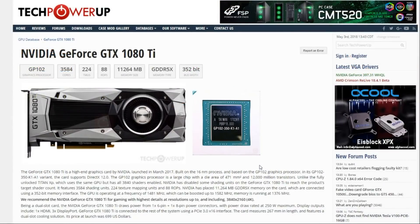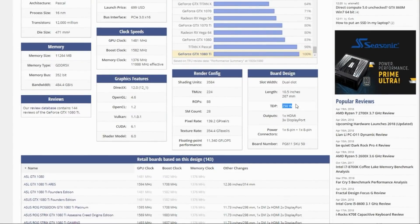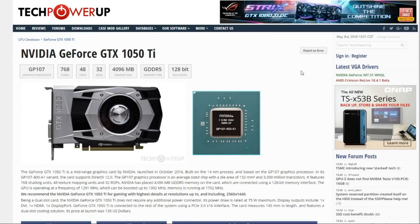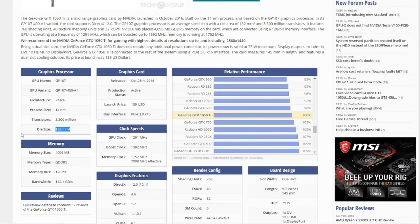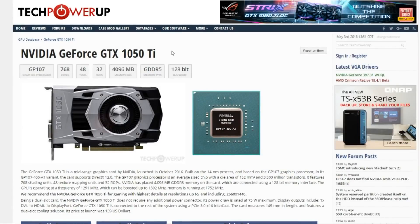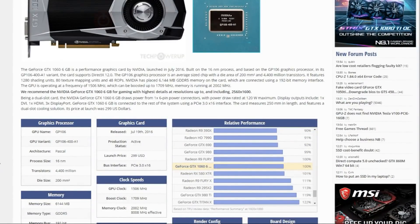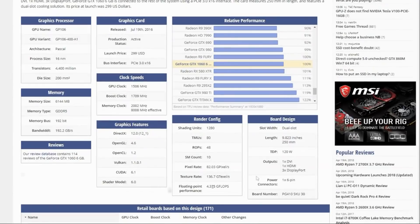However, if we're talking about GPUs, there's simply no way something like a 250-watt GTX 1080 Ti would be able to be sandwiched on top of another. That's simply not possible — it's just too much heat being produced in such a small area. This leads me to believe that when this technology does come out, they will use much smaller dies, probably something between 100 to 200 millimeters squared stacked on top of each other. In today's terms, that'd be something like a GTX 1050 Ti or GTX 1060, where the heat and thermals won't be as much of an issue as a 250-watt TDP die stacked on top of another.